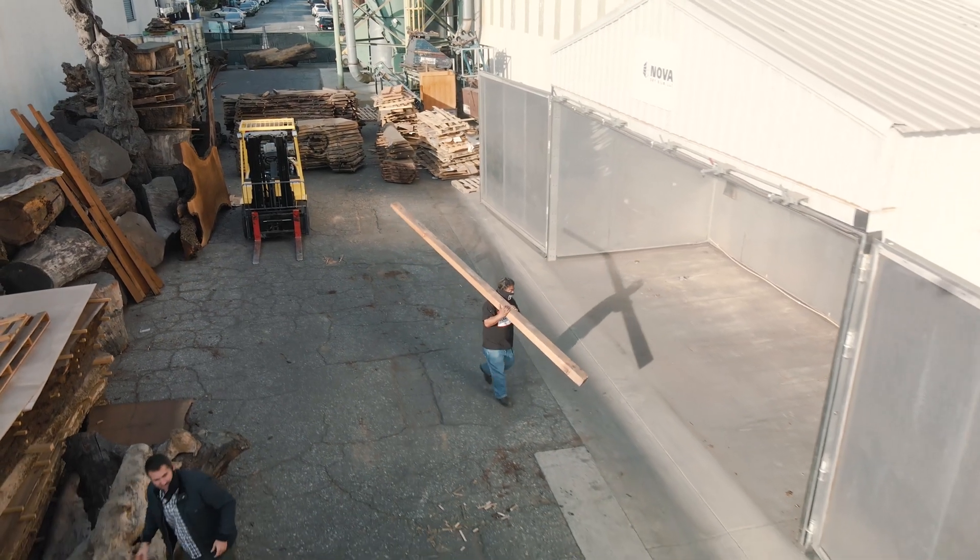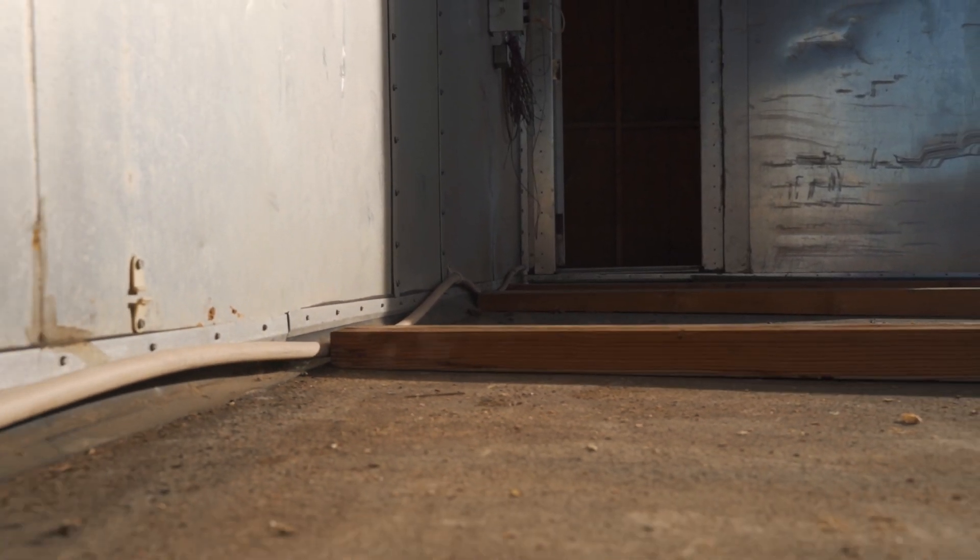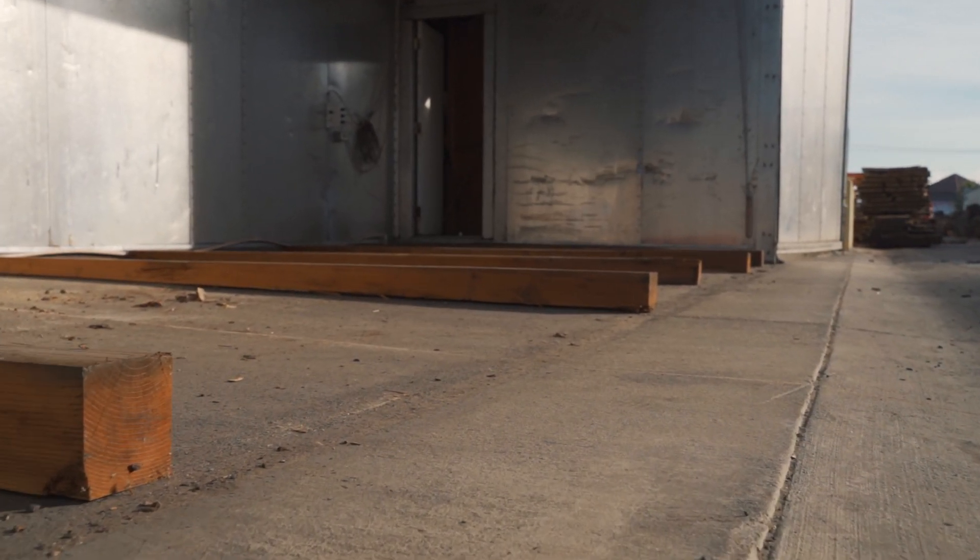Here at GL Veneer, we have a 12,000 board foot kiln that we dry our slabs in. We can stuff the slabs in here up to about 9 feet tall and 25 feet wide, 12 feet deep, getting 12,000 board feet of drying capacity in here.